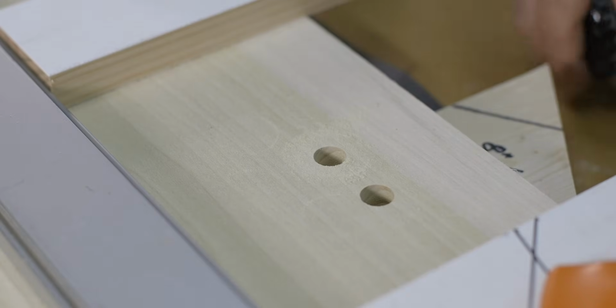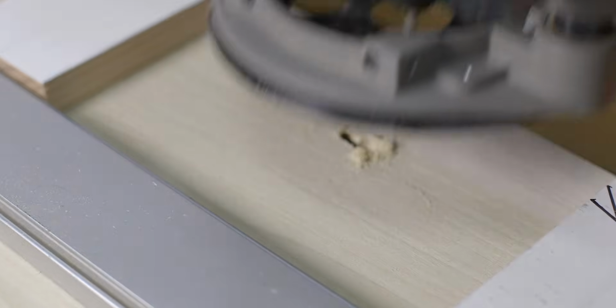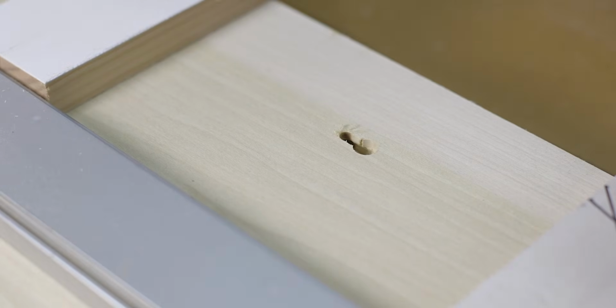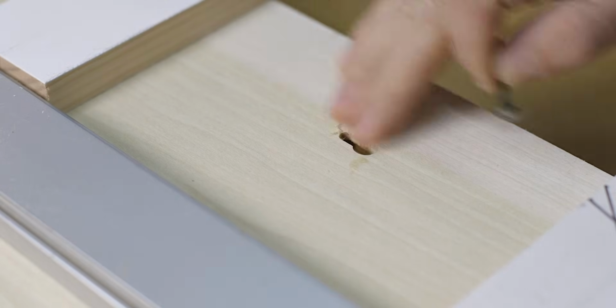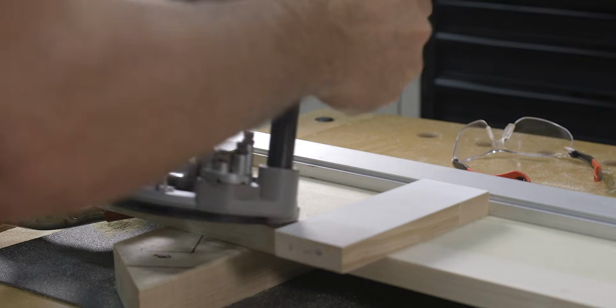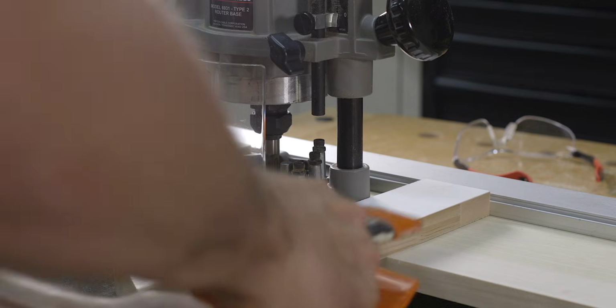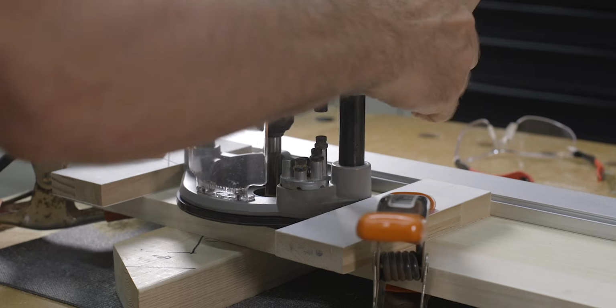2 great examples of plunge cuts can be making holes in the surface of the material, or by using a keyhole bit, which is used in the back of picture frames for mounting to the wall. An important point to make here about this technique is to be sure to use a straight edge guide and stop blocks so that you can control your stops and starts as well as maintain a straight cut.